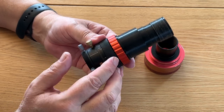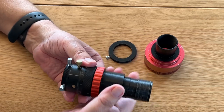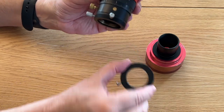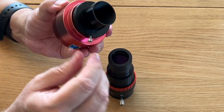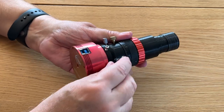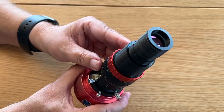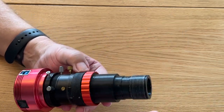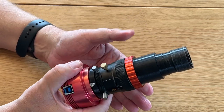The helical focusing system ZWO is now mounted by screwing and tightened a little firmly. We also mount the camera, but not before a small ring provided in the mechanical kit which allows adjustment of the back focus — you can of course print this element yourself. We tighten, position the camera in the 1.25-inch interface, and tighten. The whole thing forms a small telescope with a 125mm focal length lens in front and a camera in the back. We are going to observe a very distant landscape at almost infinity, then adjust the focusing to have its image as sharp as possible in the electronic image.